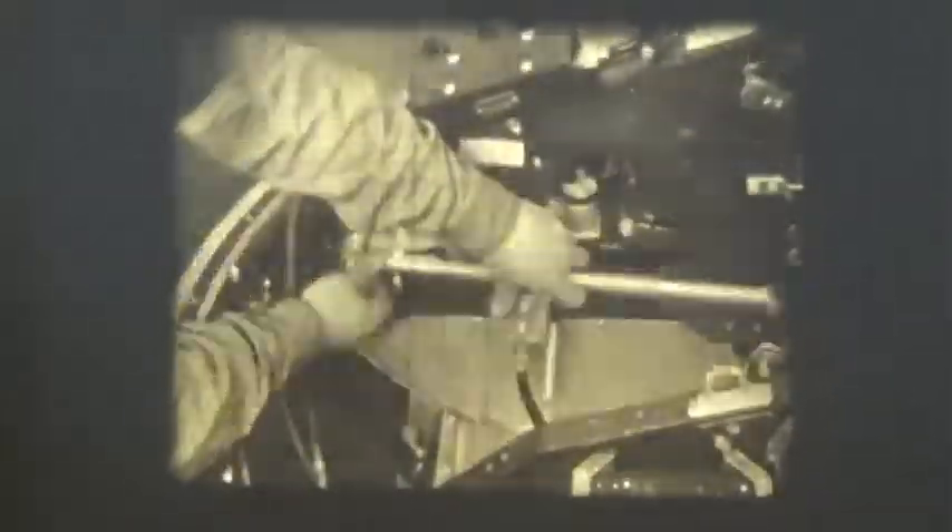To remove the azimuth side pull box, begin by unbolting the limit switch and unfasten its conduit clips. Then spring the guide, releasing the contour follower sleeve, and unhook the spring. Remove the nut from the crank. Slip the plunger off and withdraw it from the sleeve. Take off the spring.